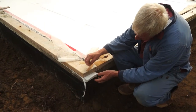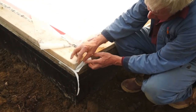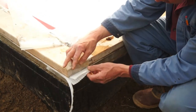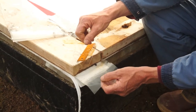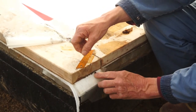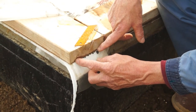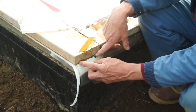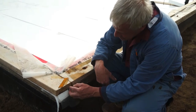What we have here is a preparation for the sill plate. Under the sill plate, we have two layers of typical foam gasket. On top of that, we have two layers of plastic with two beads of acoustic sealant. The purpose of the acoustic sealant is to create a true gasket preventing air penetration or air flow underneath the sill gasket.